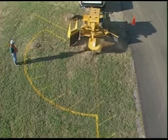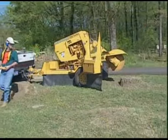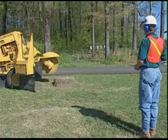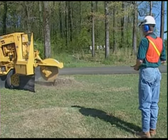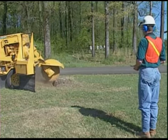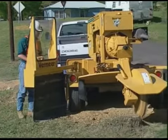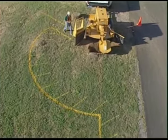Remember to always wear appropriate personal protective equipment when using the remote in the operator area. When cutting the stump, follow the instructions for using the remote found in your operator's manual. If during operation you wish to get a closer look at the stump, go to the control station and view the stump through the viewing shield. Maintain a proper distance from the cutter wheel by staying in the operator area when walking to the control station.